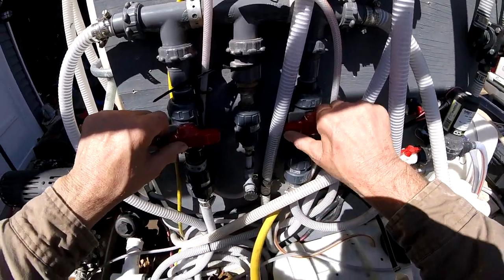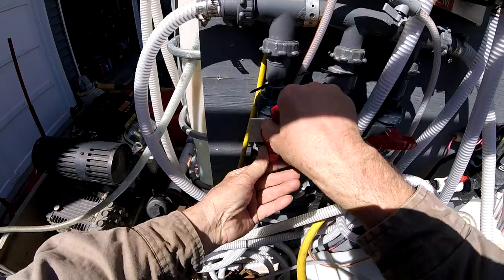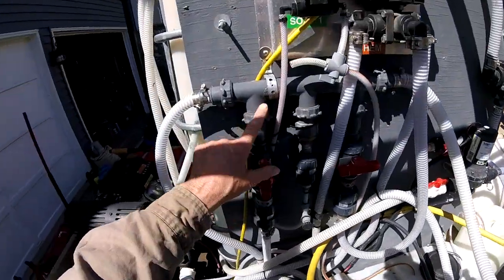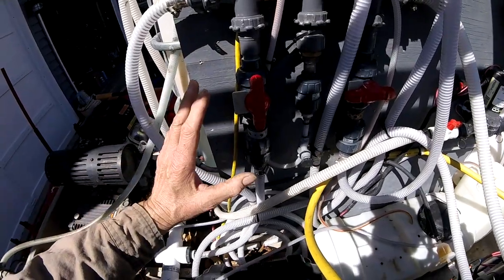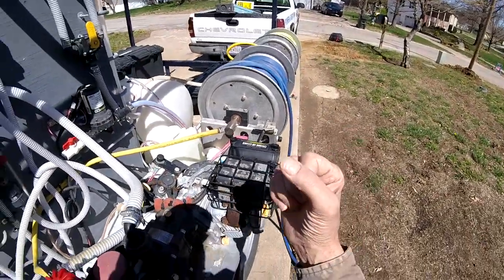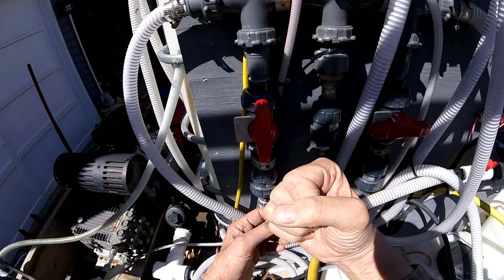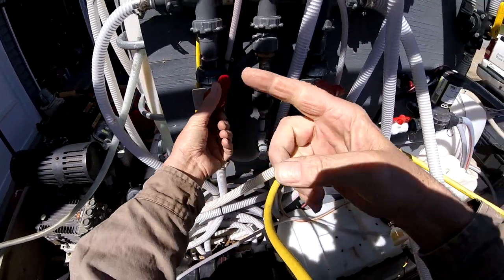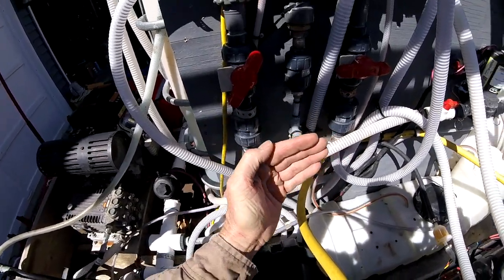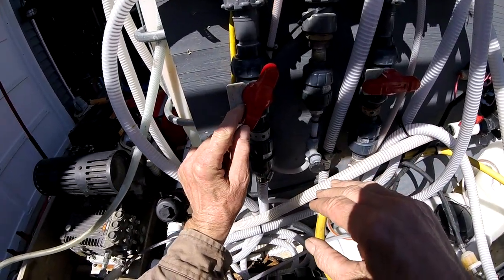The way we do this: turn off all your valves. We're going to get a baseline for where your valves need to be set. Turn off all your valves, open your water valve all the way, and start your motor — whether it's electric or diaphragm, it doesn't matter. You've got to find your baseline. The baseline is where your pump starts starving and doesn't put out the volume. While you're spraying your gun, slowly turn your water down until the pump starts laboring — on this gas pump I can tell when it starts laboring and I can see my stream go down, and it's at about 50%.